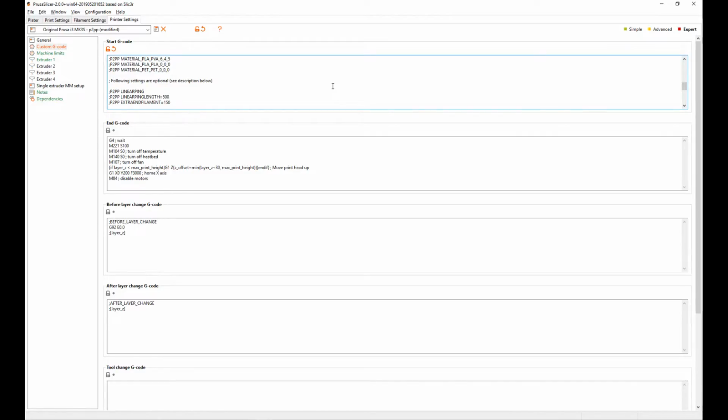When you flush that buffer, you might get a small stall. Suddenly the stepper motors don't know what to do and they stop for a little while, and then they start going again. I have this Duet 2 Ethernet, which has a 32-bit ARM processor, and the stalls I get are very, very minimal, if at all. So I don't have any ill effect from the pings. If you have an 8-bit controller, the situation might be different, because you might get a much more severe stall when it has to flush that buffer.